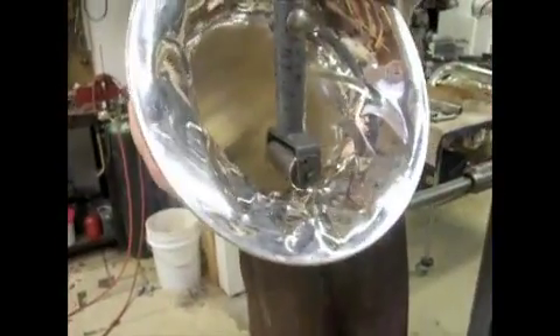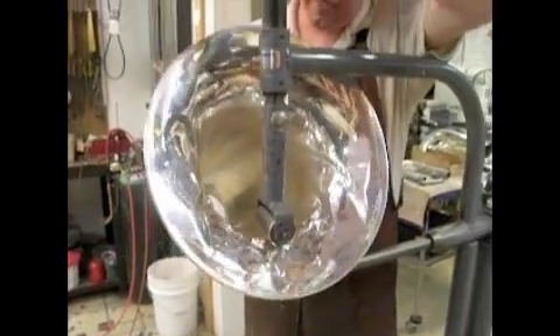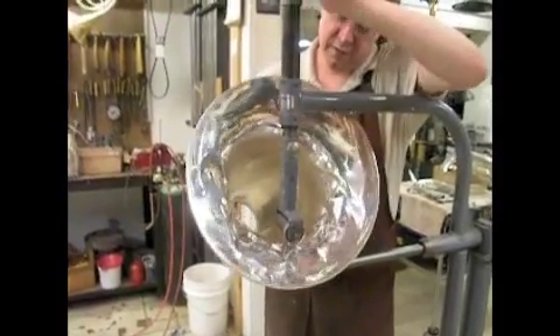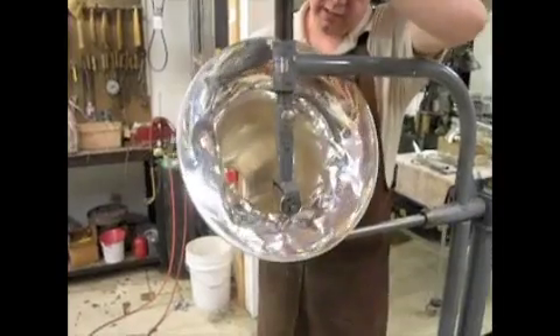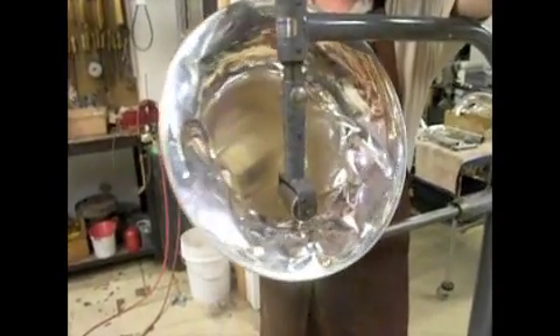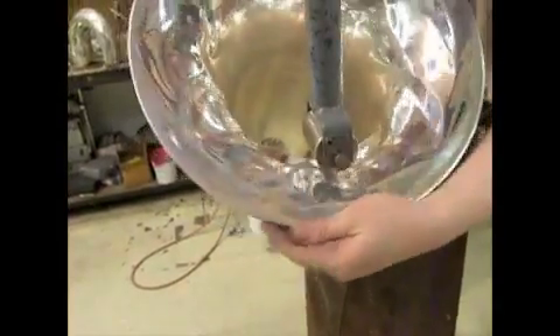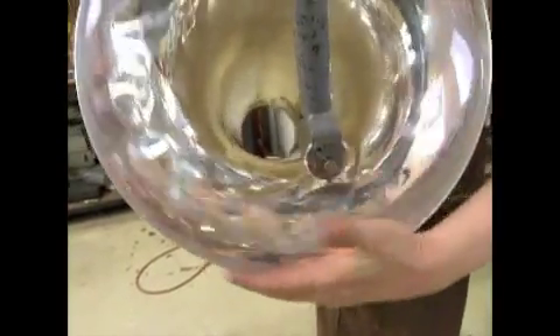Let's start in the back of the bell first. As we pulled things out, we're going to feed down a little bit of pressure and basically screw this roller down to the inside. As we come in, we can jiggle that bell around between the two rolling surfaces, and as we screw it down, it gets tighter and tighter, but we don't want to crush the metal. We're just going to feed this between the two rolling surfaces so that it will hit the high spots, and it will slowly unfold. Just find those high spots, and it will slowly increase it.